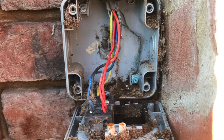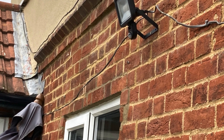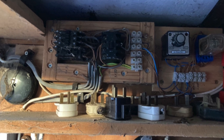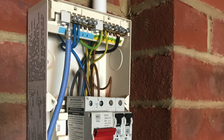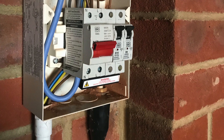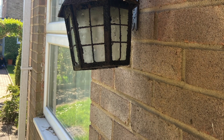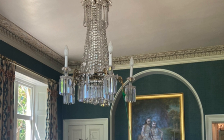When it comes to outside, check for PVC cable used externally whether it's in direct sunlight or not. For garages, check whether the earth has been exported out or whether an earth rod has been installed — that goes back to the supply characteristics. Look for any signs of corrosion and check outside light fittings that are literally hanging on for dear life having weathered a few winters.